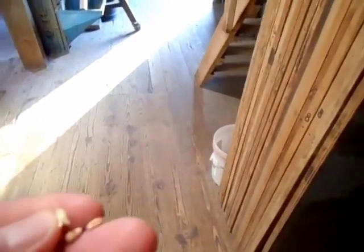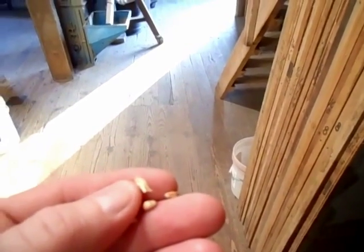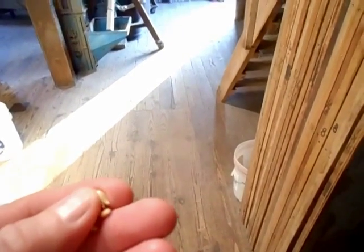But this year we had a wrinkle show up because the wheat was hard to thresh. We were getting these white caps in the wheat from the combine. That's a kernel of wheat with the husk wrapped around it, and it's slick, it's smooth. So the rolls were not removing it from the vetch, so our purity would have been low.